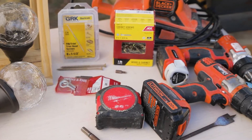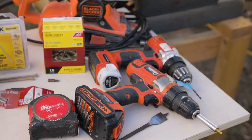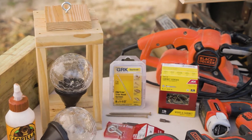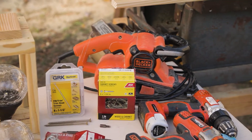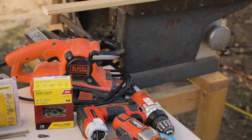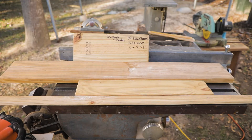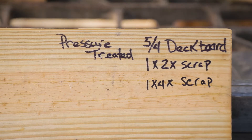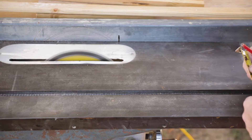Hey, welcome to our project today. All the materials we're going to show here are listed in the description below and also on the link in our blog post with more information. We're going to make a lantern with a solar lantern globe in it. We also have a bracket pattern we're going to use to hang the lantern. We'll use some long outdoor quality screws so they don't corrode. The lumber up here is a five-quarter deck board — we'll use a piece for the bracket hanger. We'll also need a one-by-two and a one-by-four cut into a square.